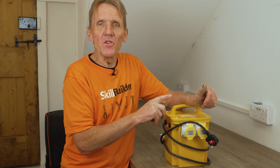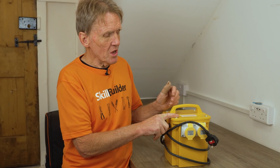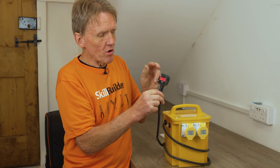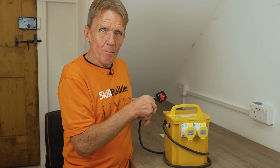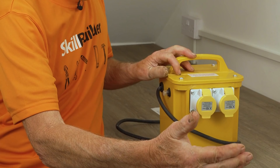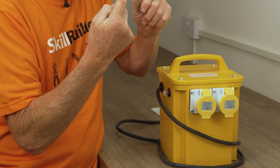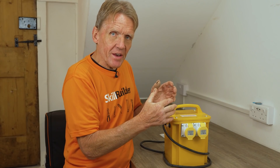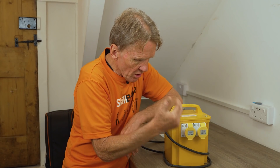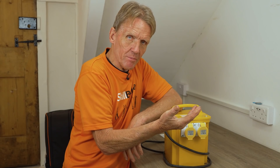The key thing to remember is that they're intermittent, they need to cool down, and they're not designed for continuous use. When you wire them up, you have to make sure your earth is connected, because even though they're double-wound with a separation between the windings, there is an earth pole in there. So you still need to earth it properly, even though the earth isn't a continuous path all the way through.